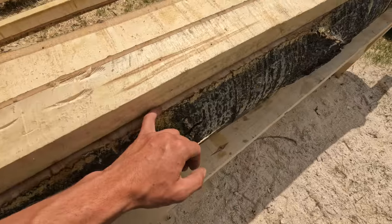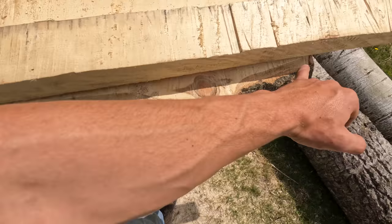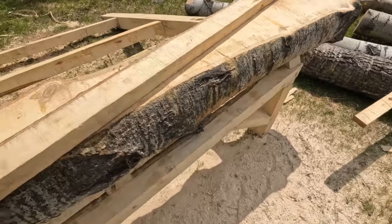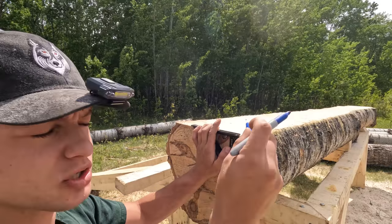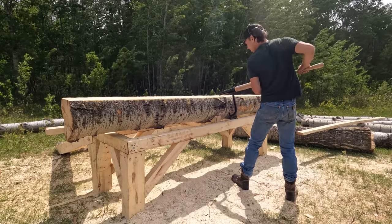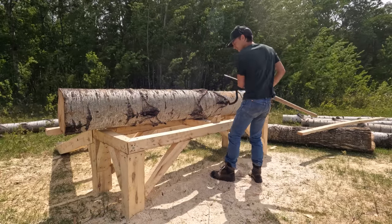If I cut right where the wood ends on either side on this log, I'm going to get a nice cut here. I'm going to take some bark on the edge of my first board, but I'm not going to lose too much, hey? I might lose some here, and you can play around with where you want to draw that line, eh? And it's square with the top, so we're creating a square piece of lumber here, and I'll just draw this line. So this is a big, big old heifer. I'll roll her over. It's a big log.